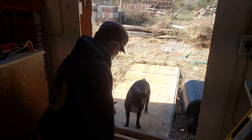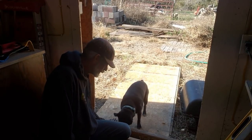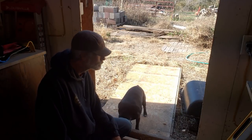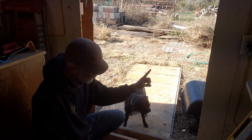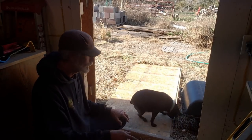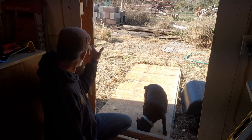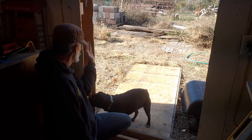So I've decided I'm gonna fill this in with 2x6 and let the door sit on this. That keeps it up off the ground. I have less chance of it rotting at the bottom. And then that means I've got to bump up 3.5 up at the top to get my 82 inches from our rough opening. And then I also have already come in and cut these back so that I can put a 2x6 in here.